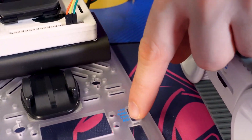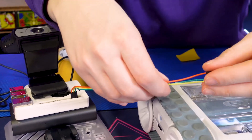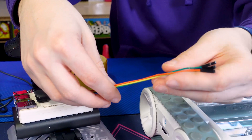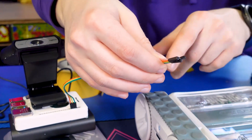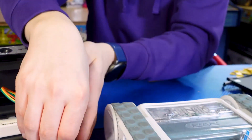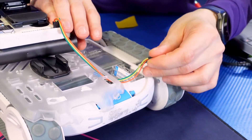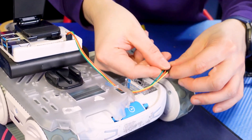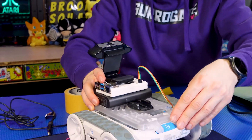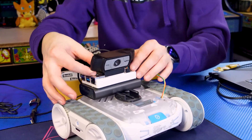You can see all the connections here: ground, TXO, and RXI. The way we do it is take all the cables, assuming they're going in the exact same way as on the Raspi pins. Orange has to go like this, and now what we've got to do is flip the two other cables — so RXO, RXI, and TXO are going in reverse. Now I put it through and attach it to the rover itself, connecting one pin, two pin, and three pin. Then we pull them through, attach the whole thing, and put the camera down so we can actually see everything.